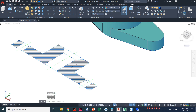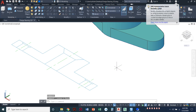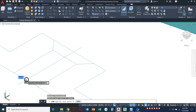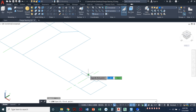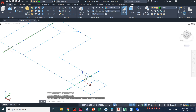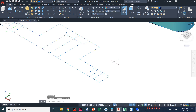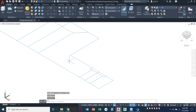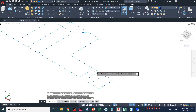Now I want to come to the front view and get rid of information I don't need, like the hatch. I'll delete that out and draw a line defining where the centerline is on the 3D layer. Then I'll get rid of these centerlines, clicking on them and pressing delete. Now I just need half of these objects, so I'll use my trim command to trim what I don't need.